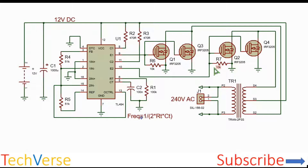You also need gate-source bleed resistors R7 and R6 to ensure that none of the MOSFETs turn on when the respective driver circuit is not operating. This will prevent any latch-ups which can cause problems in the inverter.